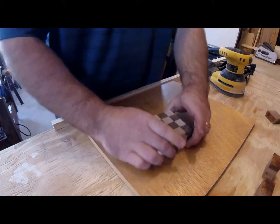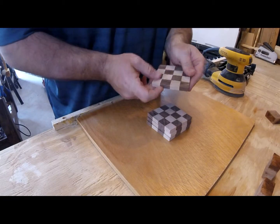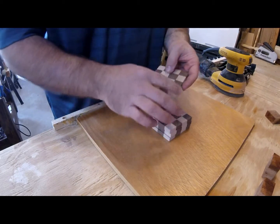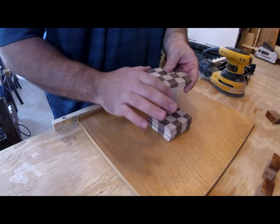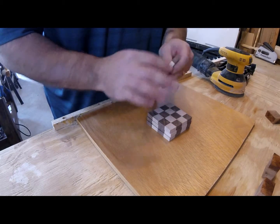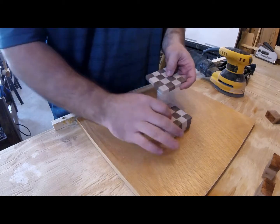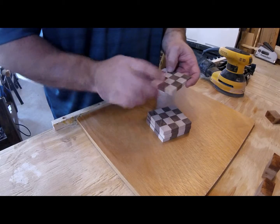So you can see when you're sanding down to 220, it doesn't take a whole lot of sanding, because at that point you're really not interested in removing any more material. You've already made the material flat and smooth. You're just basically refining the scratches even smaller. All sandpaper leaves fine scratches.